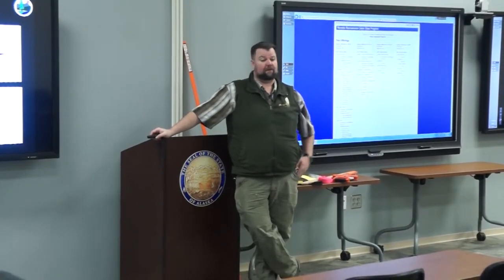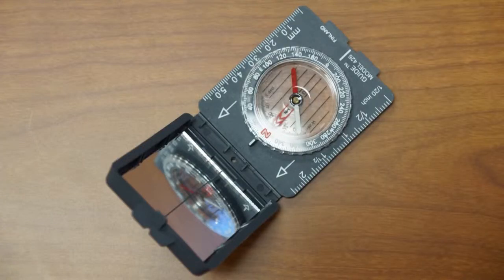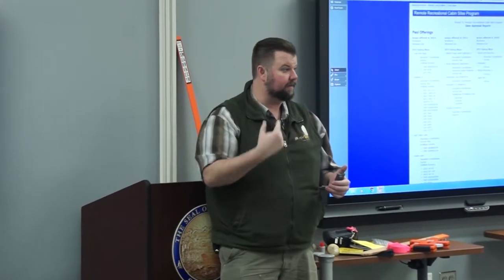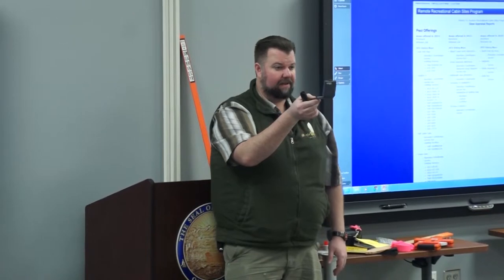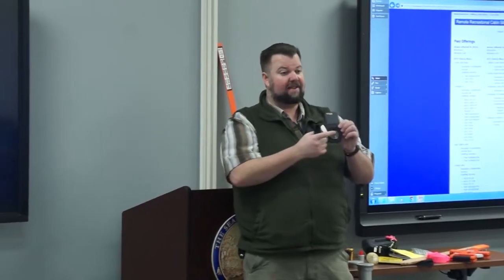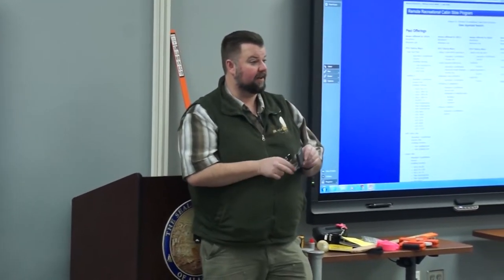Then we're going to ask you to describe the angle, or the azimuth, between them. This is where a compass comes in handy. We're looking specifically for the value in zero to 360 degrees. The easiest way is to do all your corner posts, brushing and flagging first, then walk to corner number one, set the compass on top with a flat spot, and sight right down. You can get a very accurate measurement that way. A good compass set for declination is going to help — specifically, a compass with a mirror.